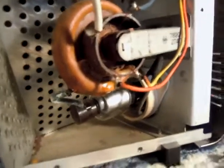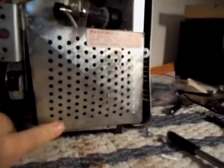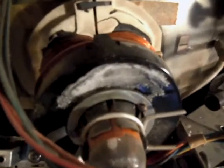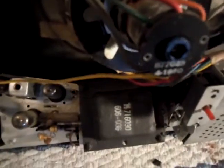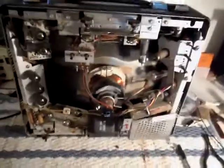Standard 1B3 rectifier. No scary wax drippings, also no rust on the set. What's common of 1950s television sets is that the plastic yokes disintegrate, but that has not happened here. There's a little bit of disintegration, and I covered that with some epoxy to slow the process, but I may actually have to have it redone.